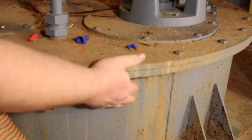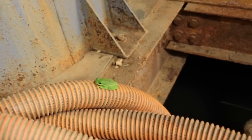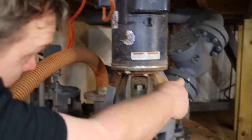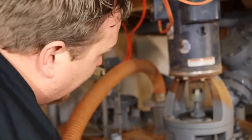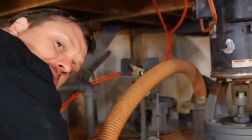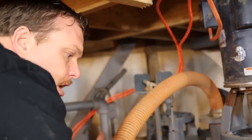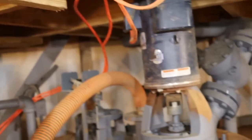This goes down about seven feet below the surface. So there's a frog that's kind of been an Easter egg in every shot — he just shows up, still alive. The water pushes out and up, and we're going to show that shot in a minute. But this right over here is the check valve — it's a one-way valve. Water goes up, doesn't come back. On occasion it sticks open, which is fun because water comes back and reverses the motor. It doesn't ever overflow, but it causes it to loop, which is not good — but it's only happened once.